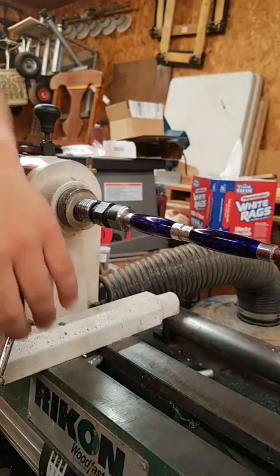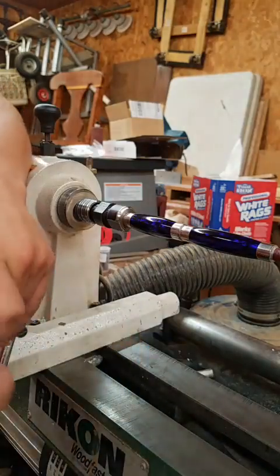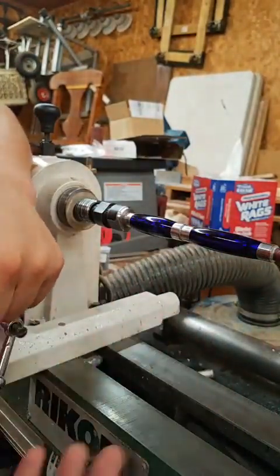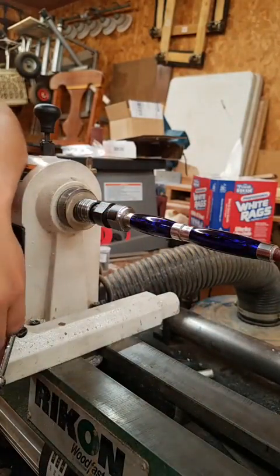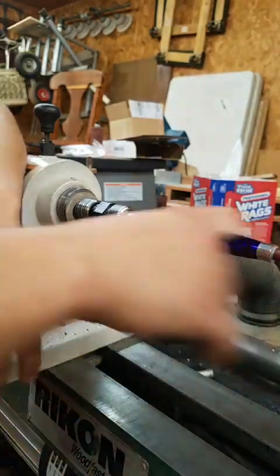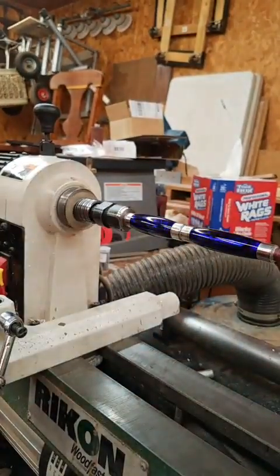That's why people spend so long drying out wood before they say it's ready to use. Because any moisture in the wood is going to make the wood warp and get out of whack. It'll be as smooth as you made it for a little while. But when it starts to dry out, the wood's going to warp some, and it's likely to crack or come off of your blank or off your barrels or something like that. So definitely having dry wood is the ticket. They spend a lot of time drying that wood before they sell it to you, because if it's not perfectly dry when they sell it to you, it's likely to blow up.